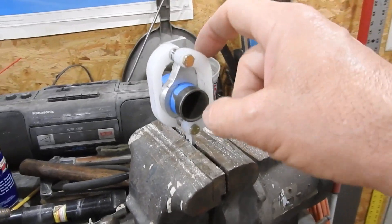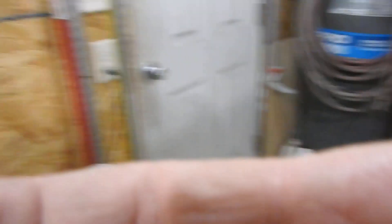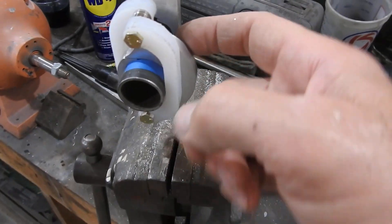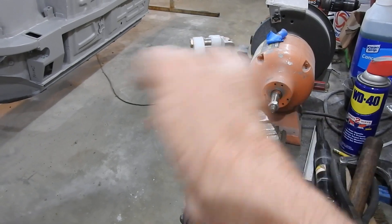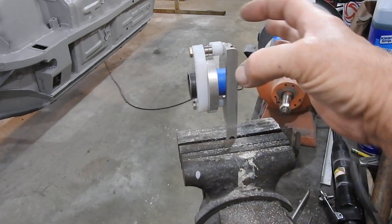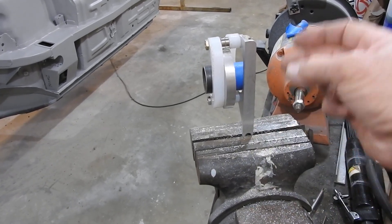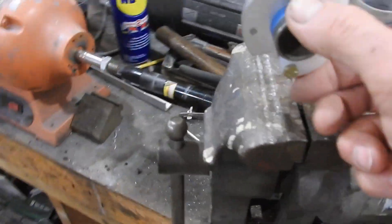It's a nice little mechanism and it should work just fine. I may end up redoing these — the plastic one's not bad, but this aluminum one has a little more clearance in it here, back in the cutout in the window. There's just a little more clearance there where this thing can rock. But again, that was just a trial fit to see what was going to work. This would have been perfect because that's basically center line, but the gear is going to hit it so it's got to be more offset. What I'll probably end up doing is machining from some four-inch wide quarter-inch thick stock — machine it across, finish another little straight tab, slot it, two screws, and fine-adjust it. These cams turned out very nice and worked real well.